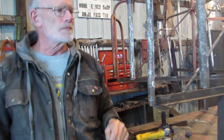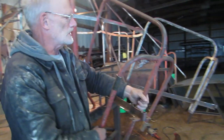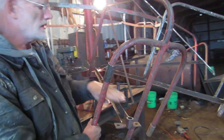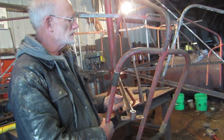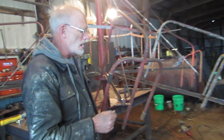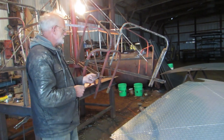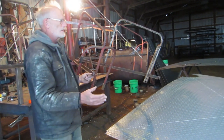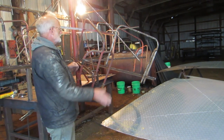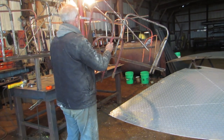So now these individual railings that a child grabs onto, I've cut them off of the tees. I'll slide the plate in, and I have my plate marked where each one of these tees should go, since they're simply bolted on. And then I'll be able to locate them, weld it to the plate, place the railing into place, and get it welded.